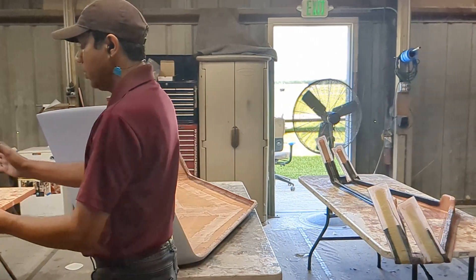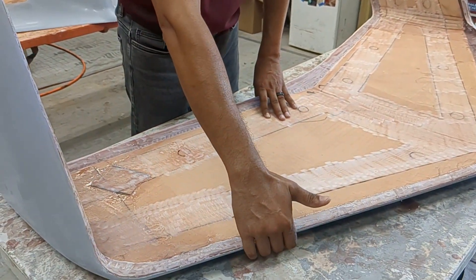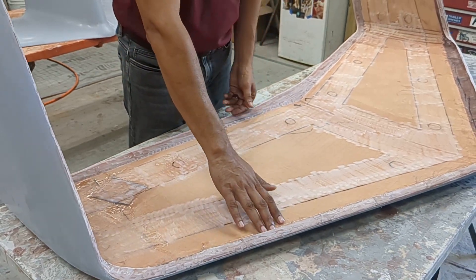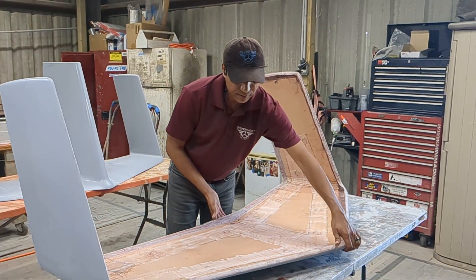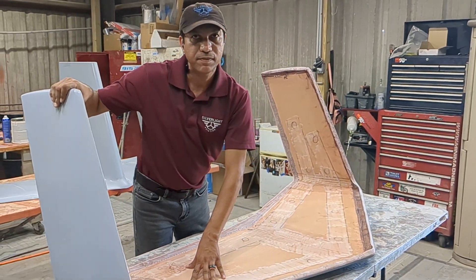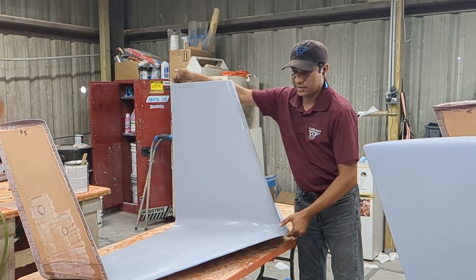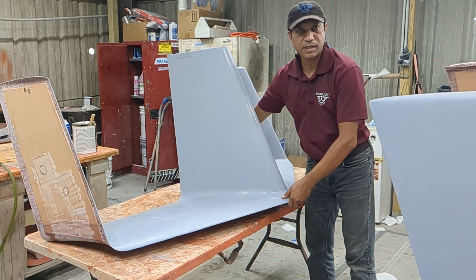So what is going on in each one of these parts? We have a layer of composite glass on the bottom — two layers. Then we have a very high density foam core. And then we have a top glass layer, and then it is infused with resin. That is one section. So if I just lift it up with just my two fingers, it's stiff enough to hold its own pretty well — fairly stiff as it is by itself, without even having all the sandwich go together. Same thing with the top half — if I lift it with two fingers here and two fingers here, it's very light and stiff. Same construction. You can see the same foam core and the sandwich of foam, composite, and composite down there.